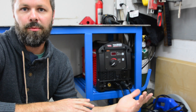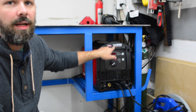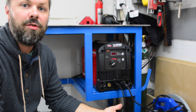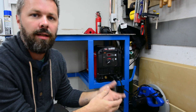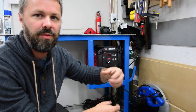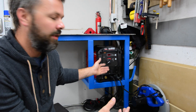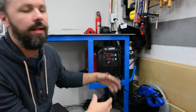So it's a really valid question — why wouldn't you just get the one that can do all three? The big difference is that this guy here can do AC welding, which is needed for aluminum, and with that comes a few extra features you need to get a good aluminum weld. That's the reason why I went with the SquareWave. You can also get a spool gun for your MiG welder to weld aluminum — you get a whole new gun with a little spot for a spool of aluminum and you're essentially MiG welding aluminum, which is also a great option. I just prefer TIG welding over MiG because you get that stacked dimes look, so it's a lot cleaner looking weld.